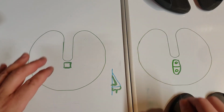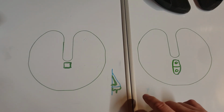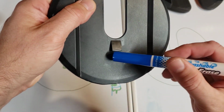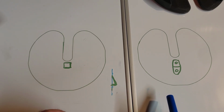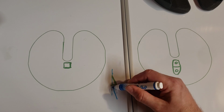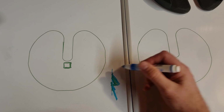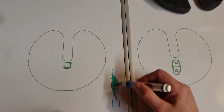I'll talk about this one in a moment, but what I usually recommend on this style with the plastic tab is that the owner cuts the rest of the plastic away, meaning all of this protruding plastic, cut it away, exposing the underlying steel tab like this. And then inserting a screwdriver or blade underneath here and prying this tab outward to make up the difference in the distance or the depth of the tab.